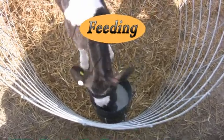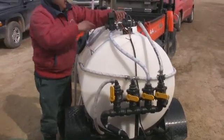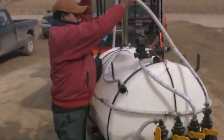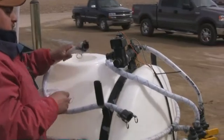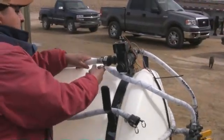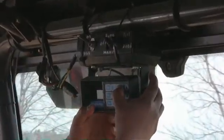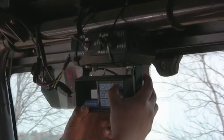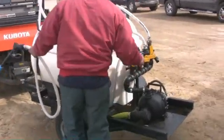When the fill and mix operation are complete, we are ready to feed. Be sure that the supply line is disconnected from the tank and that the feed line is attached to the third valve in the valve bank, the feed valve. If you are using the optional metering system, make sure that the product is passing through the meter assembly before entering the feed line. Set the control to the desired feed portion and position the toggle switches to automatic feed.